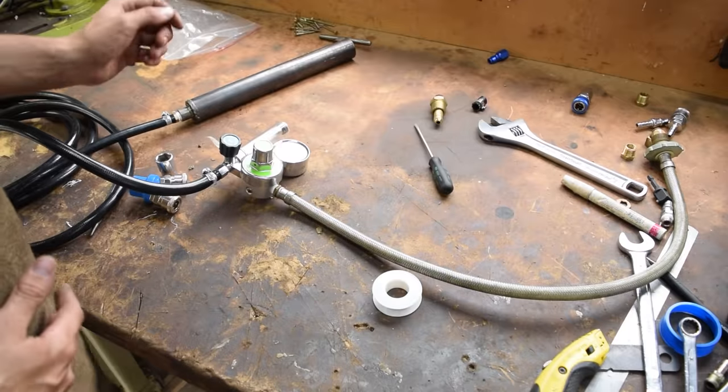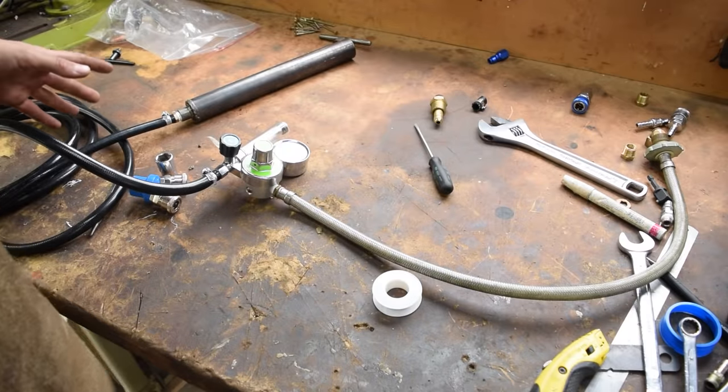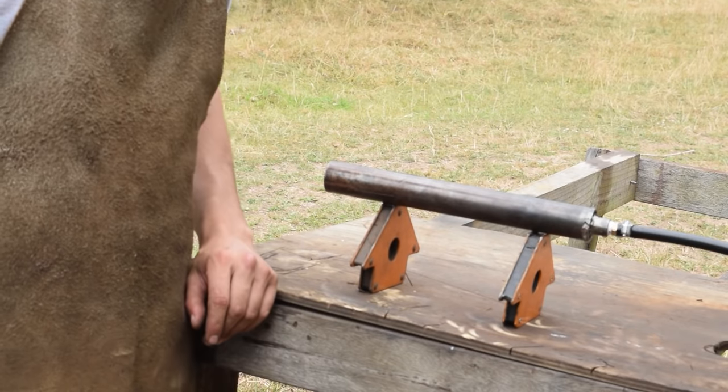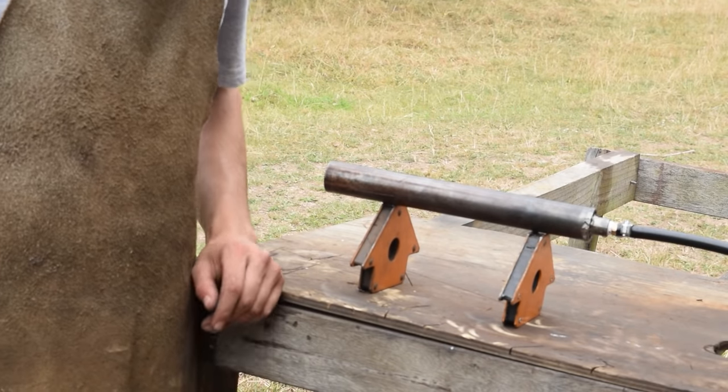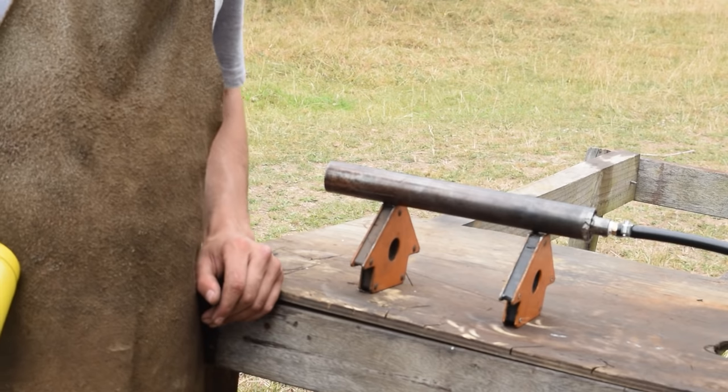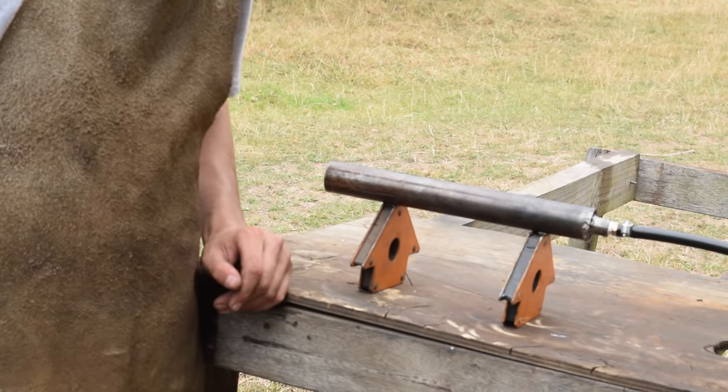Right, let's get ourselves some propane and do a test outside. I've sprayed everything with soap and water and spent the last half an hour fixing all the leaks — had to use some janky air fittings and replace some barb fittings and joiners. Anyway, it doesn't leak now, so let's do a test run.